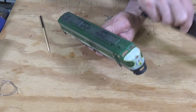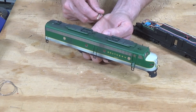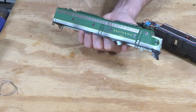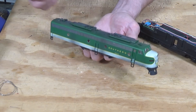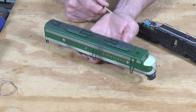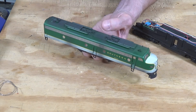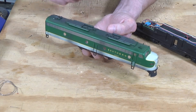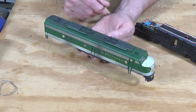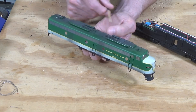I know people are going to ask about these torpedo tube air reservoirs. The Southern Railway in the 1950s, as trains started getting longer and they needed more water capacity, decided to put extra water tanks underneath the locomotives next to the fuel tanks, where the air reservoirs were for braking. So they placed these long reservoirs up on the roof. These have been called torpedo tubes because they sort of look like the torpedo tubes on PT boats used during World War II. The Southern started switching to these during the mid to late 1950s, depending on when the locomotives were overhauled.